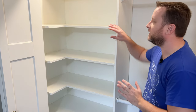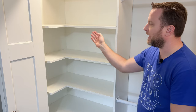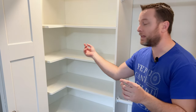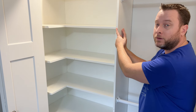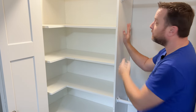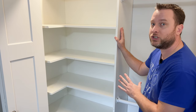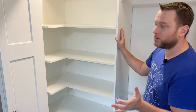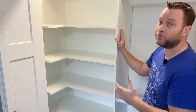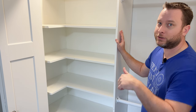The first thing I want to talk about are these L-shaped shelves. The way I made these is I made a straight long piece and then used a pocket hole system underneath — I basically glued and screwed it together. I also created a dado groove, a quarter inch into the plywood, which you can pick up at your local hardware store. I used a total of about three sheets to be safe, though you might get away with two. My plans will spell out exactly how many you need.